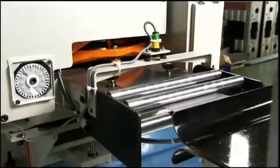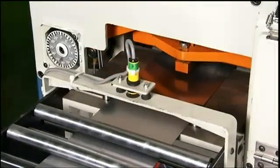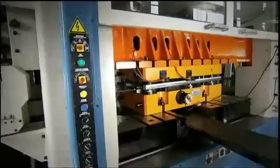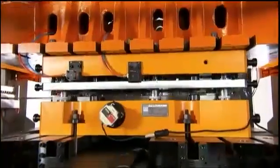The high speed feeder is the final link in the critical material feeding chain, which along with the S loop control is connected to the main control system and accurately feeds the material at high speed into the press, to ensure that each stroke is a productive one.